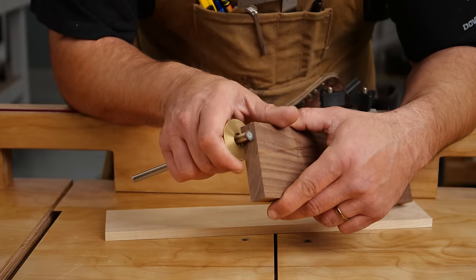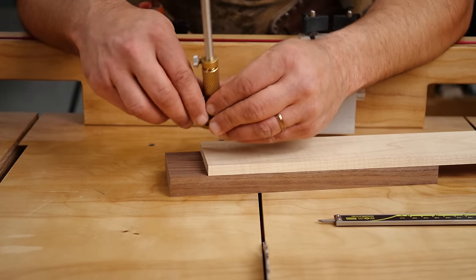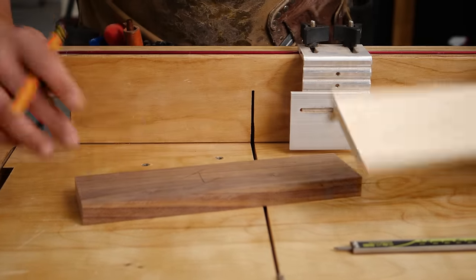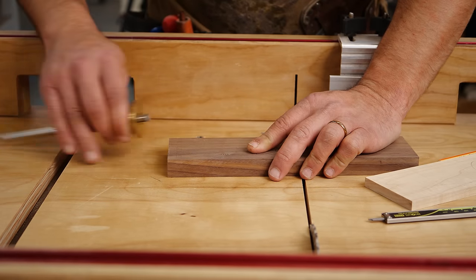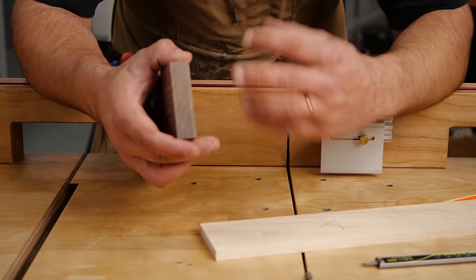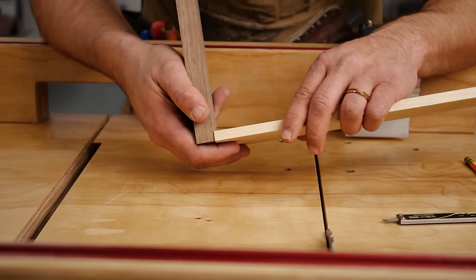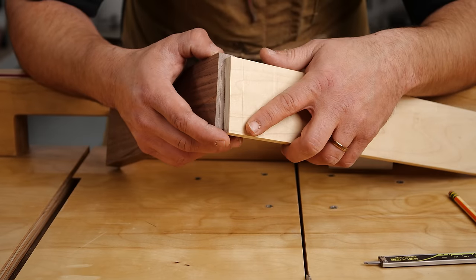There's another way to do this which I'll show at the bench, but I'll do it now. Then you adjust your marking gauge to the depth of your tails, which is the thickness of your sideboard. It's always good to label outside and inside to keep track of where you're going. Now one thing I like to do — not mandatory — is to cut a rabbet into this board. On a half-blind dovetail, the only part ever visible is right here on this face. If you had tear-out on the inside of your tails board, it would show. But a small rabbet not only helps with squareness, it helps hide any mistakes — and we are not perfect woodworkers.